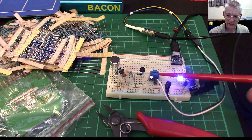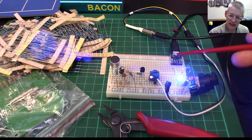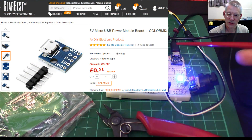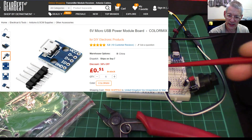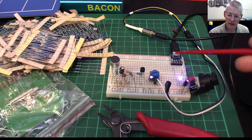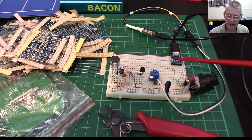This little thing at the back is a micro USB to four header pins adapter. I got this precisely so I could run my projects off a five-volt supply — plug it straight in here rather than from the Arduino — and I've had to use it almost immediately, so that worked out well.